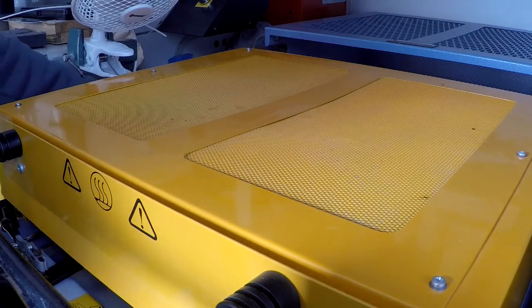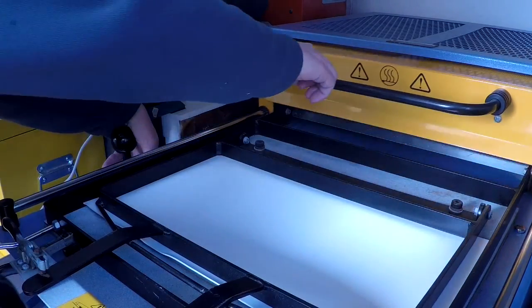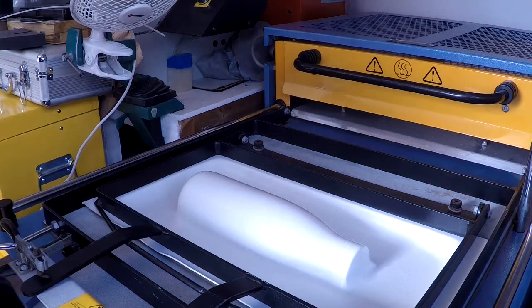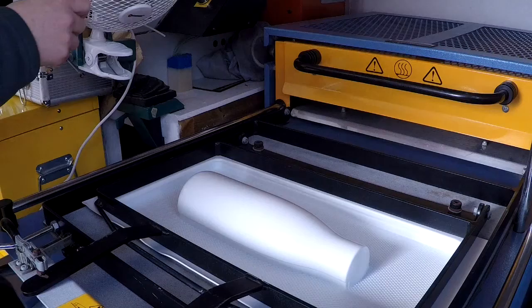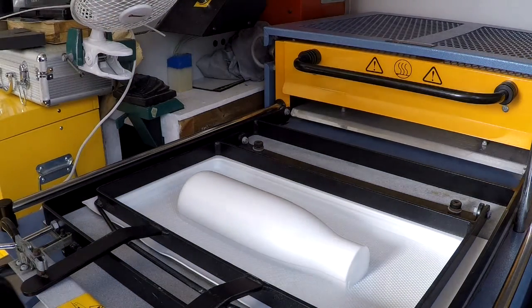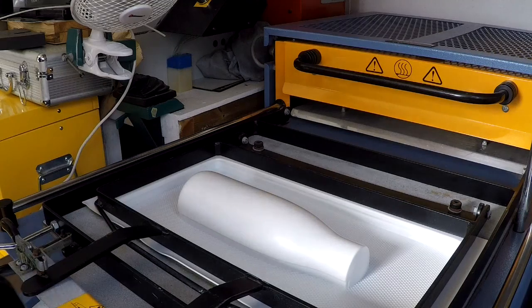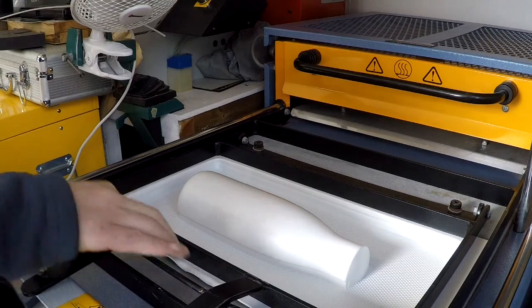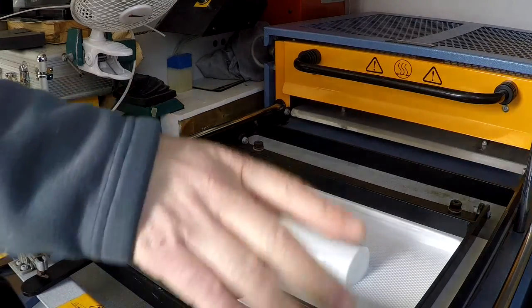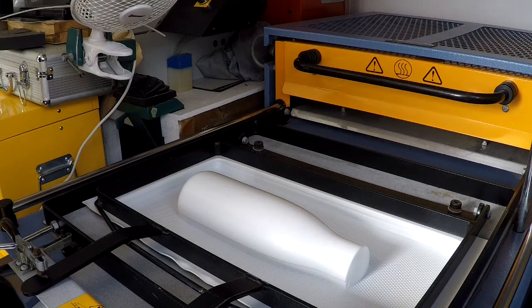So we turn the pump on, push back the heaters, lift the tool into the plastic. As soon as that's done, I've got a fan. Let's turn the fan on and cool it down as quick as possible, because the plastic is very hot, and the more you do, the hotter this all gets. So it's best to try and keep it cool with a fan.